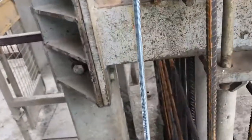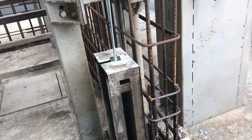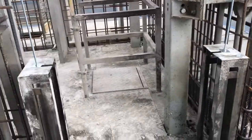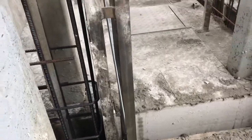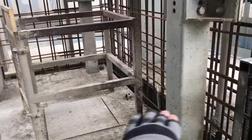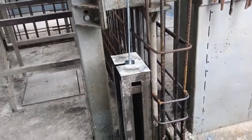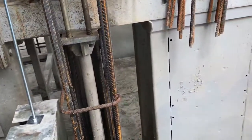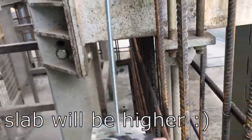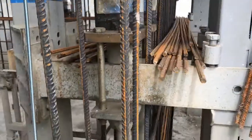You can see this is going to be for the doors. The guys have got steel shutters here, so everything is very automated. You don't need as many chippies as before - previously there were plenty of chippies putting in doors, openings, coni-bars and all that. But you can see this will be the door opening with U-bars, all as it should be. Later when the shutter goes up that'll create the lintel area with links, and the door opening will be created correctly. I've never seen the steel version before - it's quite interesting.